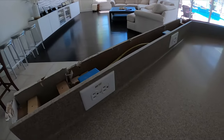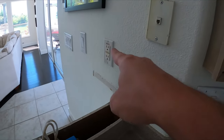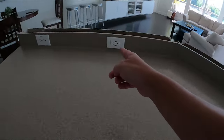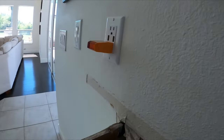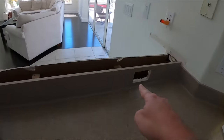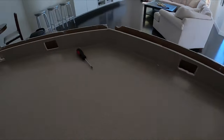Back — electrical time. Time to disconnect everything and figure out how this circuit works. We already disconnected the power at the panel so there's no power here. It's time to rip this stuff out. Electrical has been taken off all the way to this point here. Luckily it was all on the same circuit as all the other outlets, so basically every wire got ripped out all the way to there. That's done — now it's time to measure and start cutting this down.